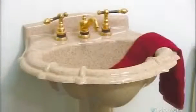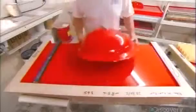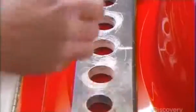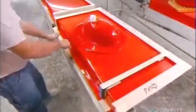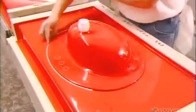This vanity top and pedestal sink are both made of cultured marble, cast in fiberglass molds. To make a vanity top, a worker centers a sink bowl mold on a counter mold, then places a drain pipe attachment over the sink mold's exit drain. He marks with a greased pencil where the faucet openings will be, then masks off areas to protect and places a beeswax seal all along the bowl's edge where it meets the counter.